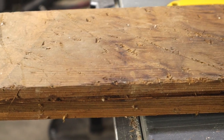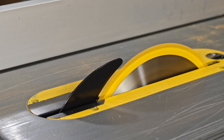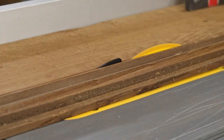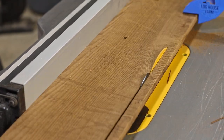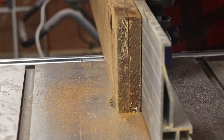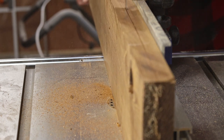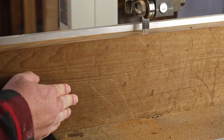So I like to give them the once-over before I start using power tools on them. The first power tool this board will visit is the table saw, because these boards have tongues and grooves on both sides, and they need to be removed. Now I have a couple of nice square edges to work with, but this board is an inch and a half thick, and that's too big for this project. So I'm going to resaw the board in half using the bandsaw. Cuts like this are the main reason I bought the bandsaw, and it does a great job cutting through this board.